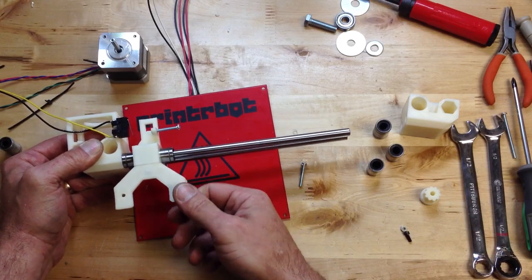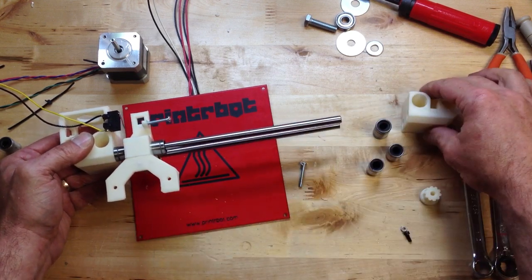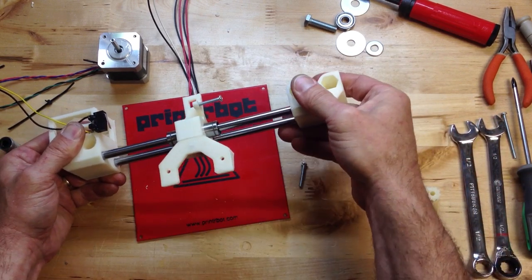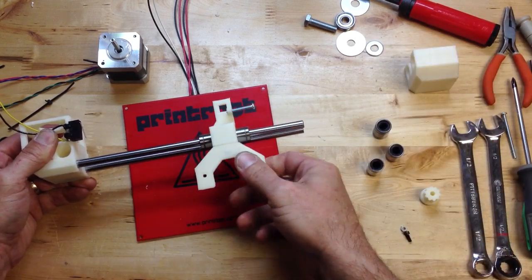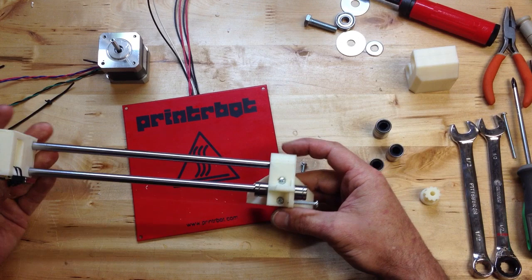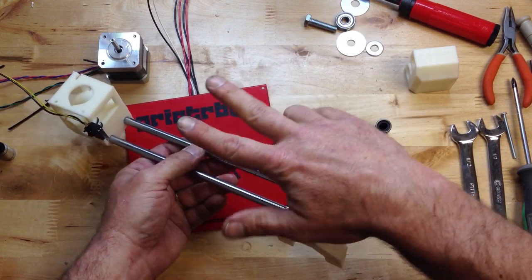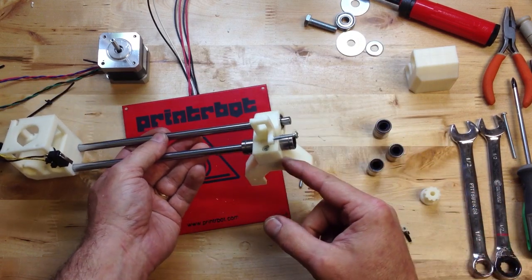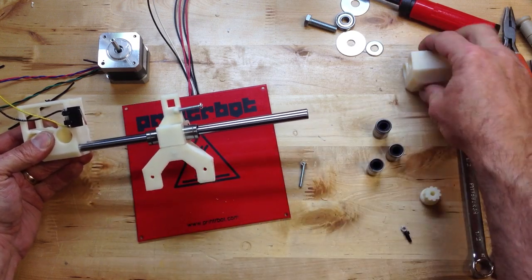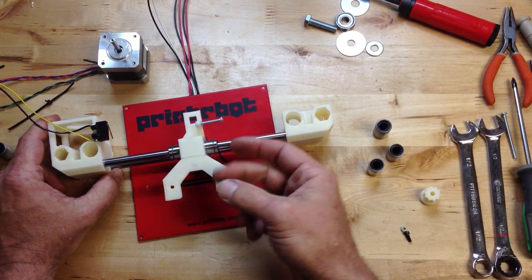I run mine with three bearings, but if you want to get all the space, you know. So it goes in like that, and you can press on this side. Having this X carriage on first is better than trying to thread these on, because now you've got forces at play here, and it might not be totally straight if these holes didn't print absolutely perfect. If there's something caught in there, it might not be parallel, and this could give you problems. Luckily on this one it went on really, really smoothly. Just be careful with those bearings. Another reason I included one is because about half of you are going to shove the bar in and pop one of those bearings out.